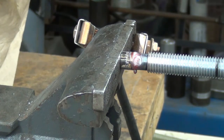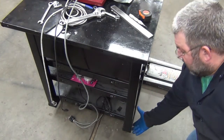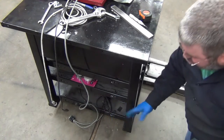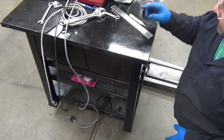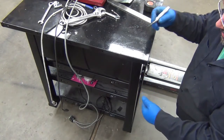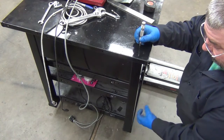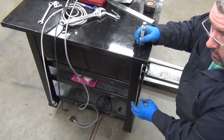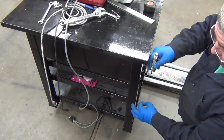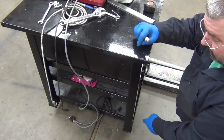Oop, I have to grind something there. So the hole in the bottom here, ouch, is set to be fairly close to the center there. And if you haven't quite gotten the gist of it, on the back side here I'm going to put a hole in the top. That foot's going to come up here with the 3/8 socket end sitting up at the top. I'm going to drop that 30-inch long extension down in there, plug into that, and then I can crank that foot from the top here.